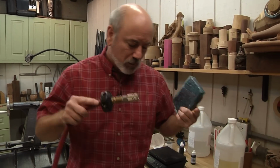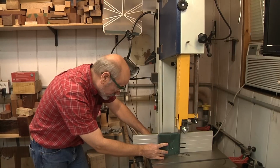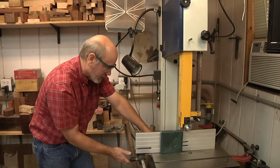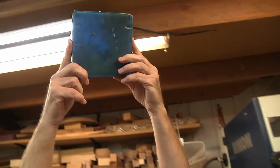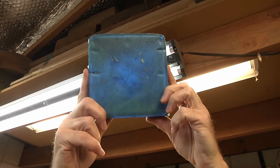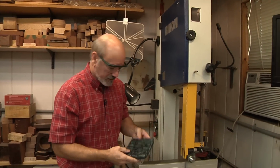So in the meantime, while that is doing its job, we're going to get on the lathe and start making the top from a blank already made. One of the cool things is that Alumilite can be cut on a bandsaw, table saw, anything you want. And this is a blank I made earlier that, if you look up, see if I can get a light in here, you can see through it a bit. That's what I was after. I wanted to have that translucent look. So this is the one with 4 drops of color in 16 ounces. Yeah, and a little bit of that silver stuff.